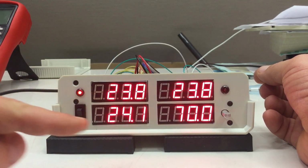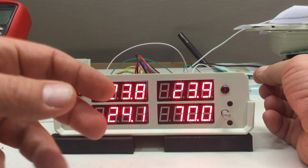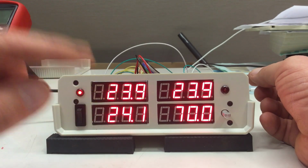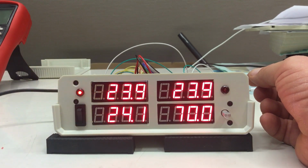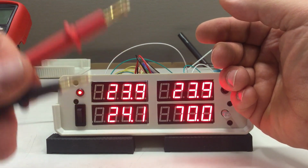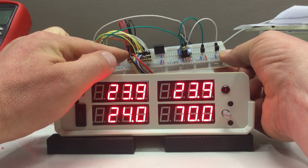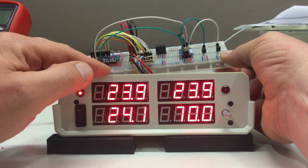To get here, it was not without a little, quite a big hiccup. The first time I turned it on, all displays stayed black, absolutely black. And after some debugging, first in software and then, before checking your voltages, check your connections, I noticed that the crimp connection of the data line to the displays was dead as a dodo.